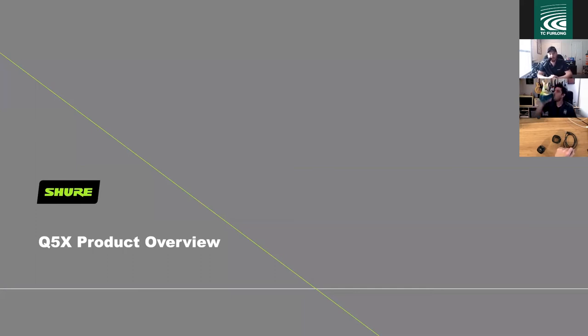And these transmitters initially were analog emulation transmitters. So what that means is they would emulate the analog modulation scheme of popular products like Shure UHFR or Shure Axient Analog. They could also emulate modulation schemes from other product competitors. And so when the world started to go digital, what happened was those analog transmitters became not usable, because they weren't functional with the new digital receivers that were coming out from multiple manufacturers.